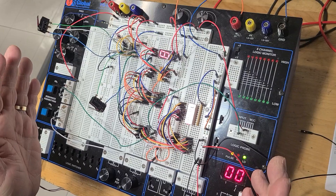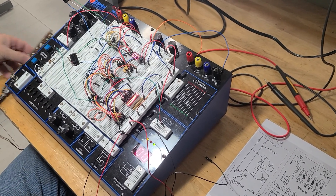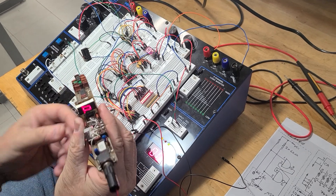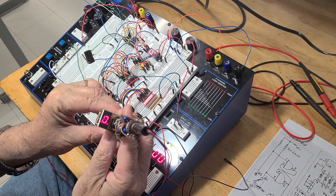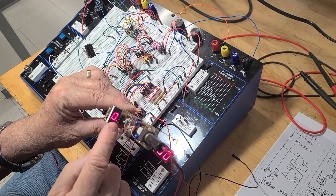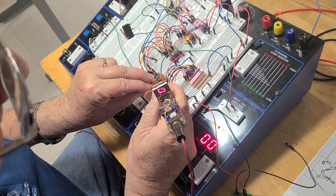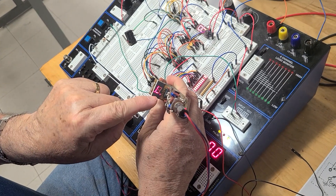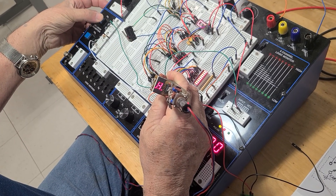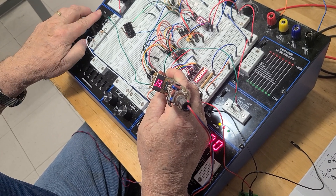The project is working just fine. Now we want to take measurements using the logic probe. In logic circuits there are three basic situations to measure. When the probe tip isn't measuring anything, it's in a limbo state — neither logic zero nor logic one. My probe shows zero in that state. When you touch a pin, you see 'L' for low. If I press the reset button, it goes high and shows 'H' — and the counter resets to zero. Low, high, low, high.